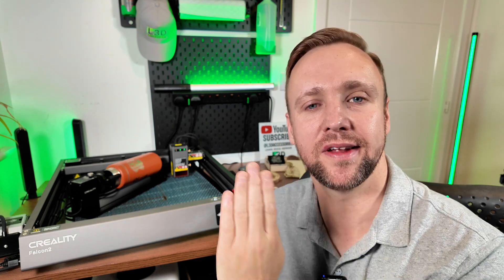My second con is the framing accuracy. The laser itself is very accurate. However, to get the laser lined up on the item before you start an engraving — to make sure you centrally position your item or your design — it's a bit of a learning curve. Because it's such a well-made bulky laser module, and there's a little window on the front that stops light from escaping, it's quite hard to judge where that laser nozzle is facing. I found it was a bit of trial and error at first. You can use Lightburn to send a 1% power light beam down, but looking through that window makes it quite hard to see. It doesn't limit the machine, but it is something to bear in mind.